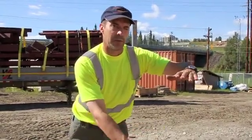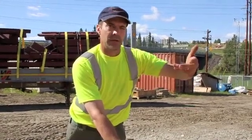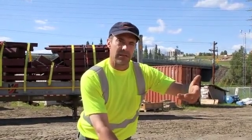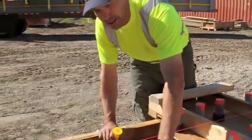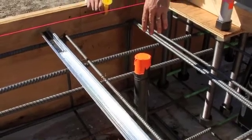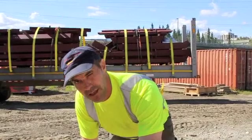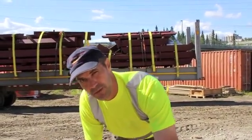The spread footer will probably get squished down a little bit and the grade beam will come up relative to the spread footer. Once we have the building back to level there will be a gap between the grade beam and the spread footer. These tubes will allow us to inject structural foam down through the grade beam — cut it open, stick the foam nozzle down through, and fill the void between the grade beam and the spread footer.